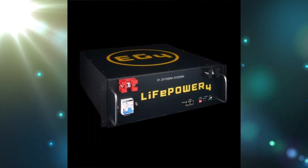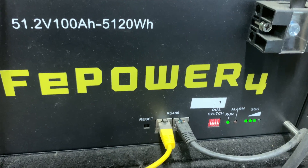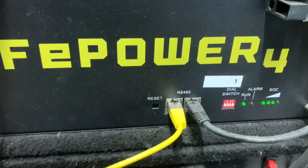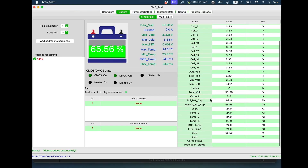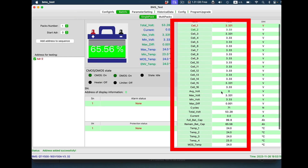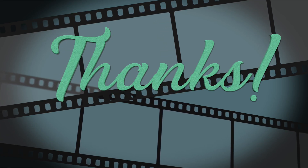At the beginning of this video, I asked the question: what is a shunt and do you need one? Well, maybe you don't need one because it would be redundant in your system. For example, most rack-mount batteries come with either CAN or RS-485 communication interfaces, so your battery is already talking to your inverter. Or you could hook a computer up to those ports and see everything you need to know — from the overall state of charge to the individual voltages of each cell. That wraps it up for this video — see you in the next one.